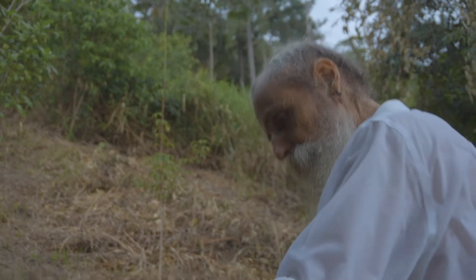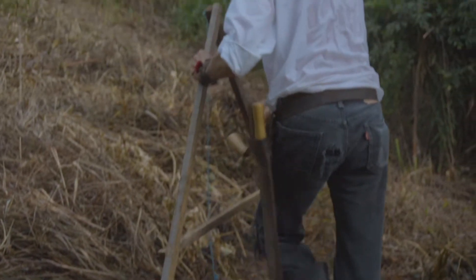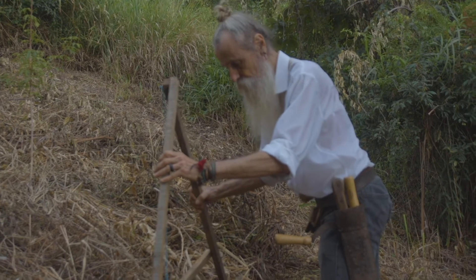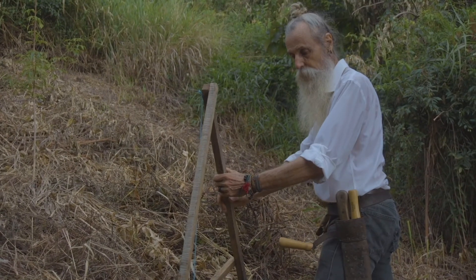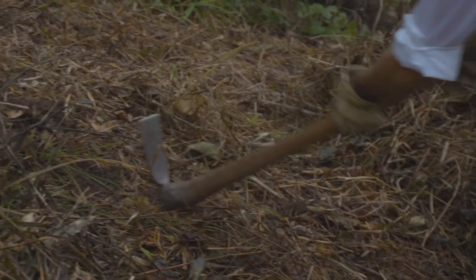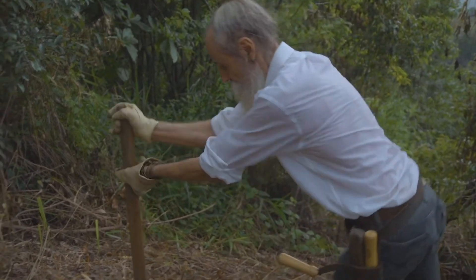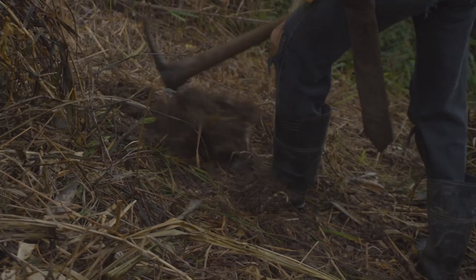Having established that position, we put a mark and then we flip it and move the leg up and down until we've got it lined up with the line on this side, and then we get a constant gradient all the way up on our zigzag trail. I use the pointed end of the mattock to join my marks that I put on the ground with the A-frame, and then I go back and create the little benching. Using the other side of the mattock, I get the flat pieces for walking on.